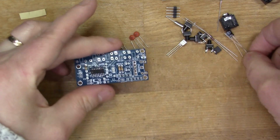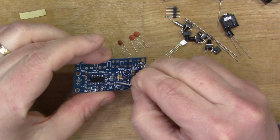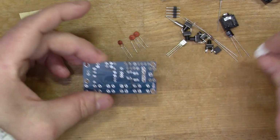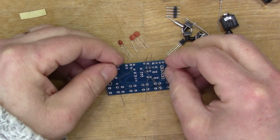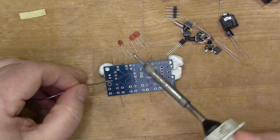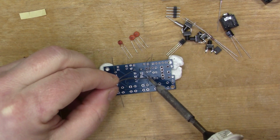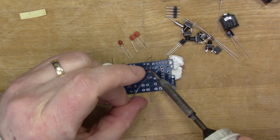And also, as I said, in this case we're quite lucky because some people have already built this kit and published details online. So I'll leave a link in the description below to one of the sites, which is quite nice because the guy has actually worked out the circuit diagram, which is especially useful in this case because there's no readily available data sheet for the chip. Sometimes one of the tricks is that if you look at the data sheet, they have a reference circuit, and so you can see what components are really needed to make the chip work. And a lot of these Chinese vendors base the kits exactly on the circuits that you find in the datasheet. So if you have the datasheet, you actually have the schematic.